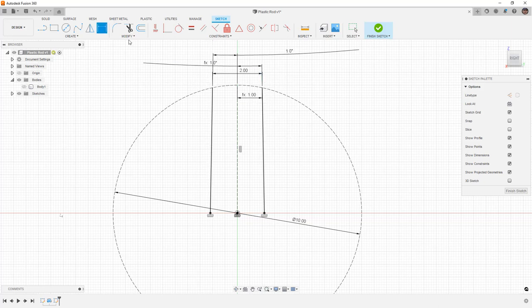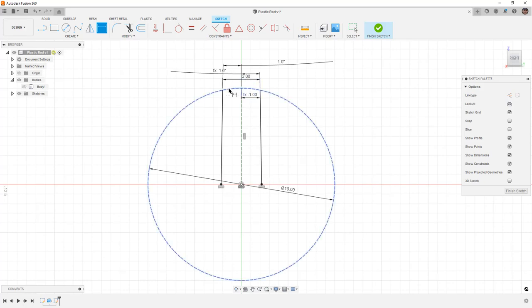In general I'll create some parameters that house things like the draft angle and wall thickness, but we're going to skip that step for this design. This design now gives us a rib that we can pull vertically. However, we don't have anything on the left and right hand side, so I need to use my line tool. Remember we're drafting from the z direction so this can be completely horizontal. We do have the arc to worry about — I haven't handled that arc section yet and we'll come back to it. I'll use the dimension tool to make sure this is at least one millimeter, again using two millimeters divided by two. We are going to mirror top and bottom, and I'm going to draw the one on the other side, making sure it is collinear rather than perpendicular, which will automatically control its height and location.